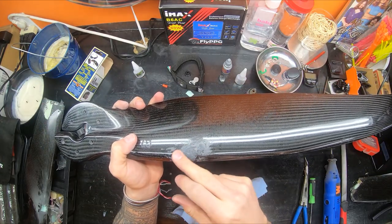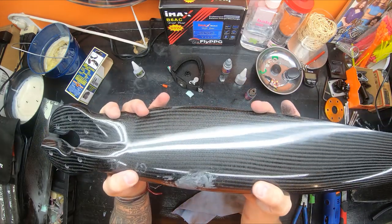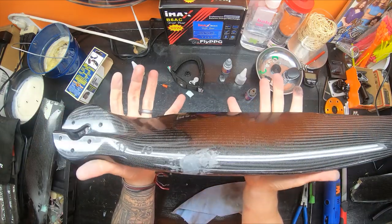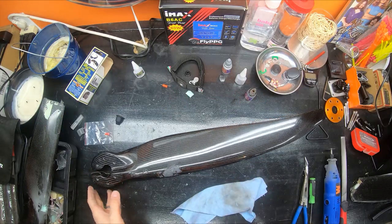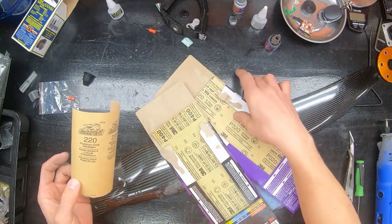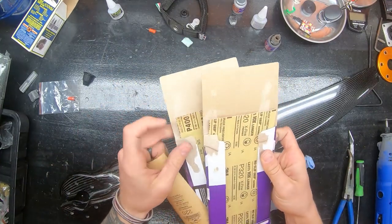You could polish this up really nice and it'll just be a nice black spot, barely noticeable. I'll get a couple rounds of sanding done and then buff it at a later date. Starting at 220, going to 320, then 400 — and at the 400 point I'm going to wet it.